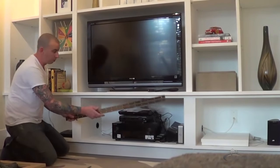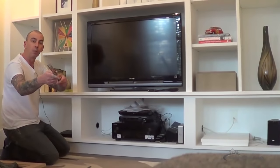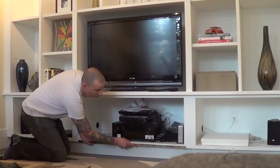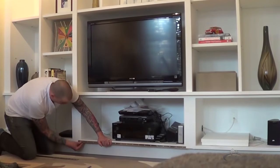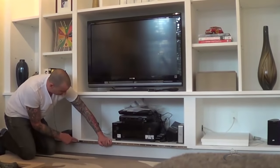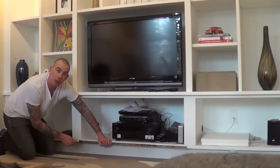I'm going to begin to set the hinge in a backward manner, as wide as it'll go, so that I can lock it on this corner perfectly. That way I know that I'm exactly flush on the underside. And I'm setting it flush to this end, knowing that it'll be flush on that end, and that's what I've built the door to.